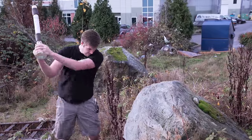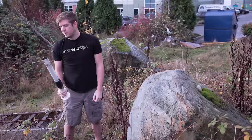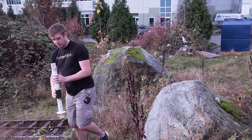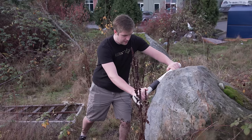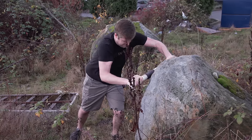Then it was time to test it. So it did come off, but that's actually because I deformed the entire pipe against the rock. The problem here wasn't the strength or rigidity of the FiberFix — it was its ability to adhere to the pipe, which I did score quite a bit, although admittedly I didn't get all of the paint off.